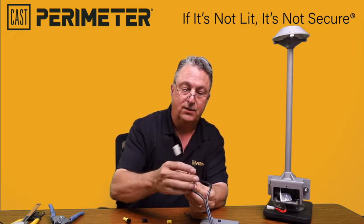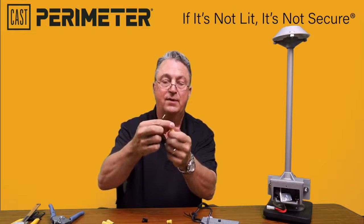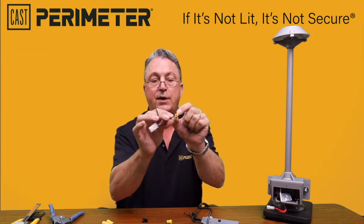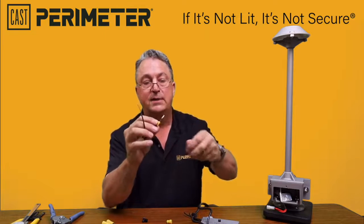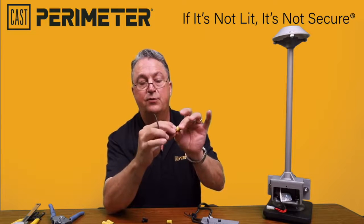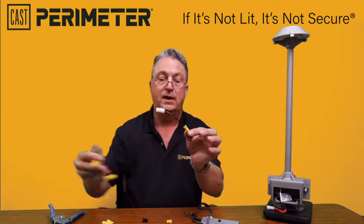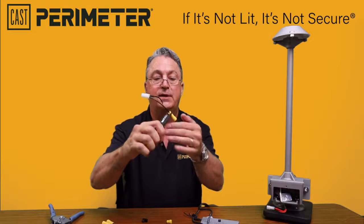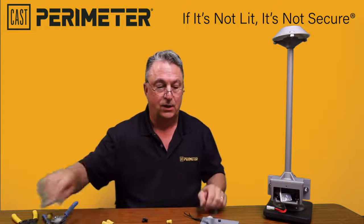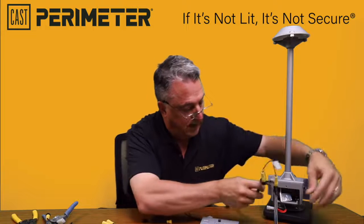Then you take and screw down the cable piercing connector. On the top connection, make sure that you do not twist these little wires. Run it through — there's what we call a mandrel — it's going to go between the mandrel and the outer wall. Tighten this down, and there's a little jaw at the end that allows you to make a nice snug, secure connection. Make these connections on both pieces of wire.